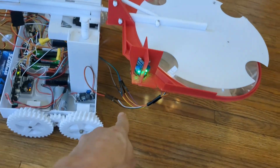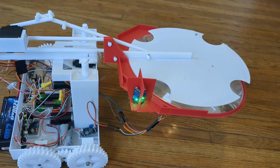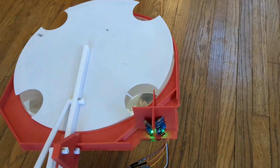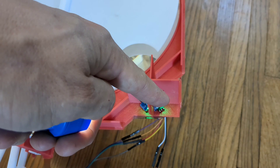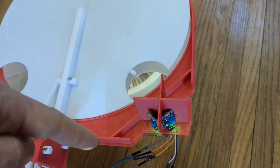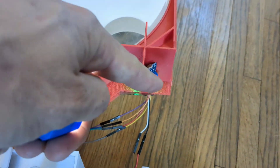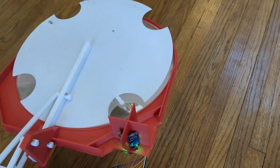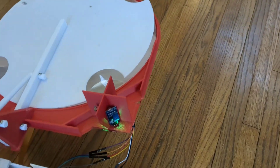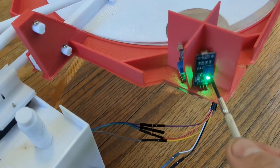When you're hooking up these sun tracker wires, you can do a quick indoor test before you take this thing outdoors. If you're standing behind this, this is quadrant one, quadrant two, quadrant three, and quadrant four. The pins are six, zero, thirteen, and five — that's how those are hooked up. Once you've got the power and ground hooked up to your 3.3 volt DC buck regulator and you want to test this, the easiest thing to do is take a small screwdriver and control the potentiometer output.